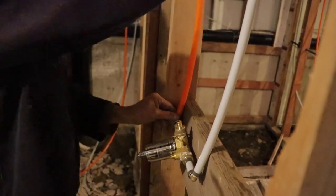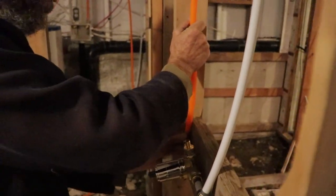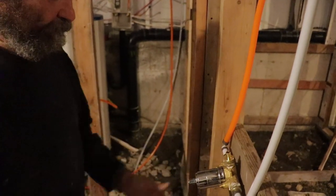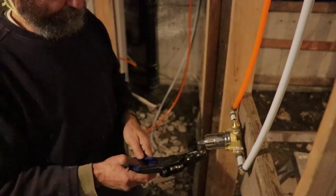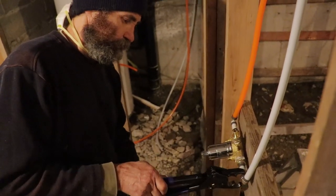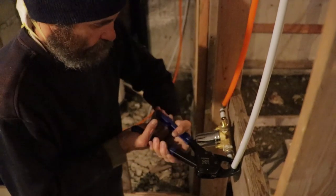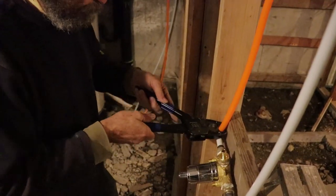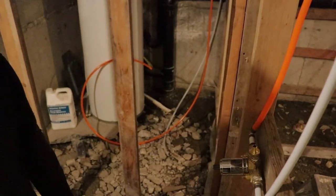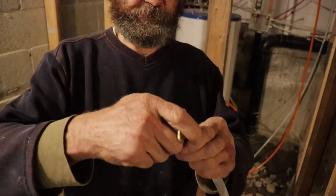This cutter is just easier than the knife. We just cut it, and then I put a ring. Just position it and leave enough gap — keep the pipe a little bit loose, that way you can clamp it to the wall. Once you have it there, piece of cake — just set up the pipes and the ring, put it in, go to the other side the same way, and press it. This one here is the shower head pipe — we're just gonna put it there.